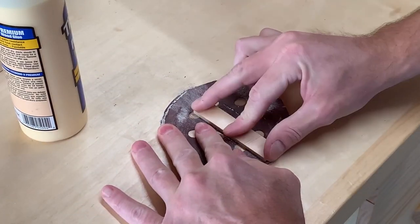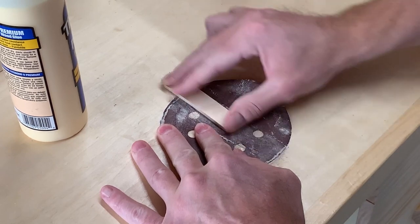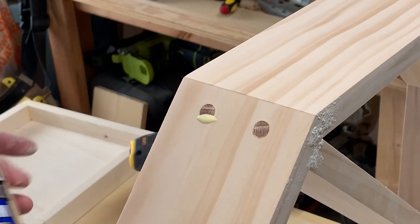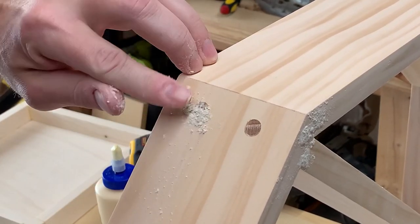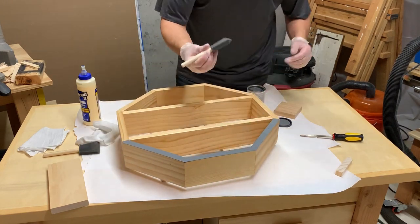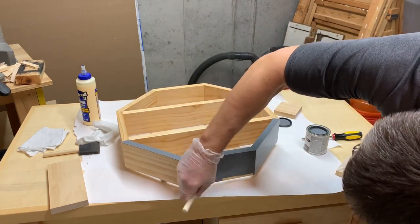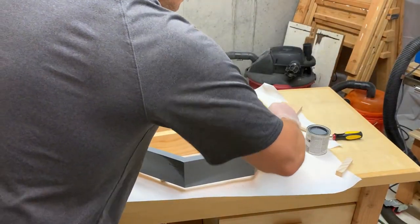To fill in any slight gaps, I employed a cool trick I had tried before but kind of failed with — it's the glue and sawdust trick. Last time my sawdust wasn't fine enough, so this time I sanded off some dust specifically for this application. The finish we decided on was a weathered grey stain. I have to say, I really hate staining — and to be perfectly honest, staining really isn't a fan of me either. But I forged on and managed not to get stain anywhere I didn't want it to go. I'm actually really impressed with myself that I didn't walk away wearing any stain.